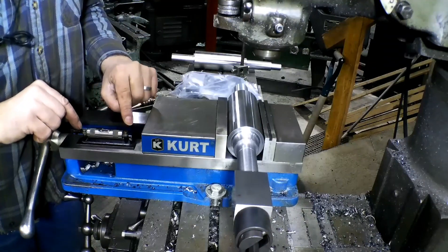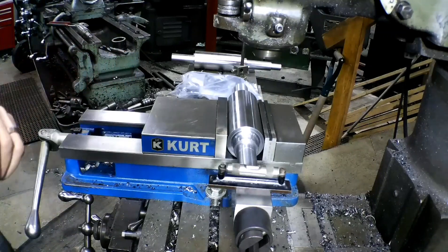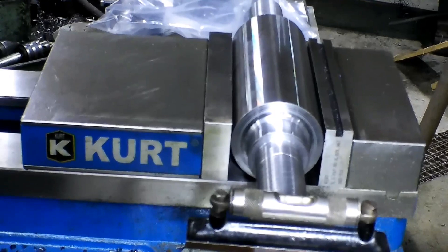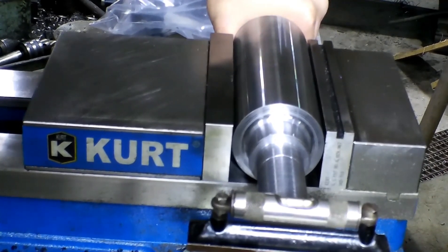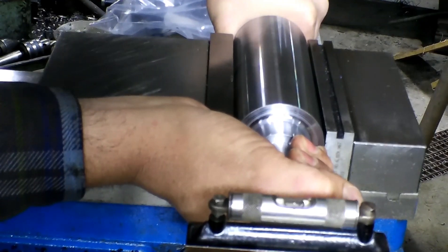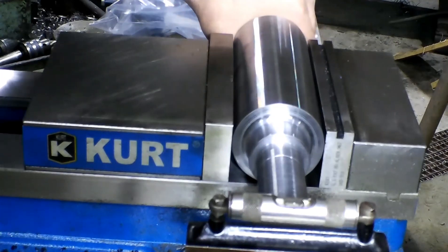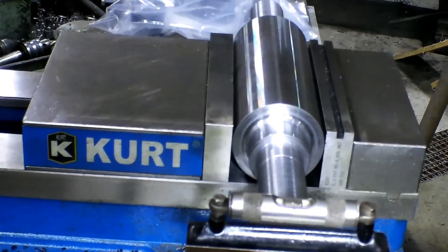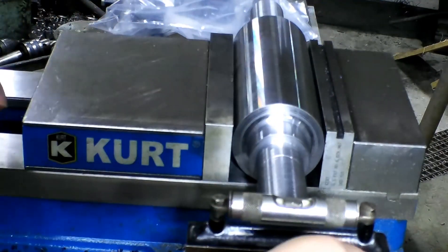These levels are adjustable — you can adjust your bubble and get it where you need it. Then move it over here. Now you've got these features you need level, so you just turn your level — or turn your part in that collet block — to match what you had back on the ways. I am very close, just a little off from what I had. Right there — that position is perfect. Now you can do your work. Make sure this collet block is locked on tight — that's the key — with good engagement.